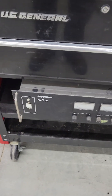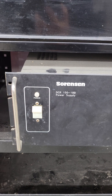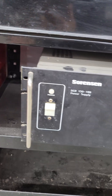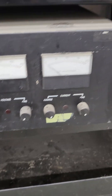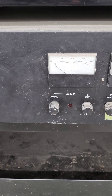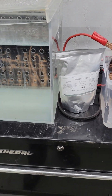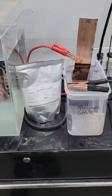For power supply, we've got a pretty big power supply here. This is a 220-volt Sorensen — it's a huge laboratory-sized power supply. It's got a rack mount, so I'm assuming maybe it was server. It's old, a couple hundred bucks on eBay surplus, but it goes 200 volts, 20 amps, so it does really well. Usually I just crank the amps all the way up and then adjust my voltage to what I need it to be. I actually use a multimeter to get very specific voltages for color, because you can go 30 volts versus 32 volts and that can make a whole different color depending on the sub-finish you have.